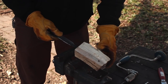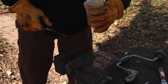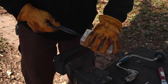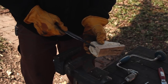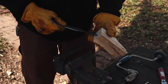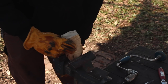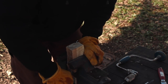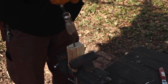The bit was more than long enough, but the tang is getting hung up right in the middle. It's on there pretty solid and hard to get off. I could heat it up and try to burn the tang the rest of the way in, but burning the tang in just makes the opening of the tang hole bigger — this part will get hot too and erode the mouth where the tang goes in. I'm really not a big fan of doing that. Sometimes it might seem like a quick fix but in my experience it hasn't been, so I'll keep drilling.